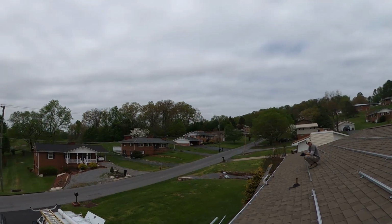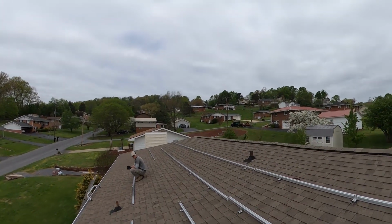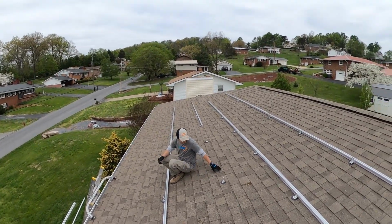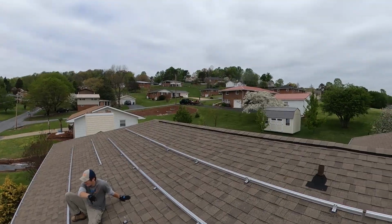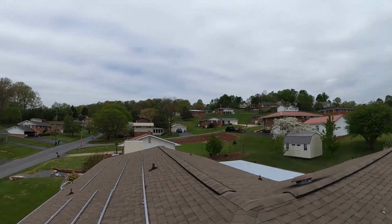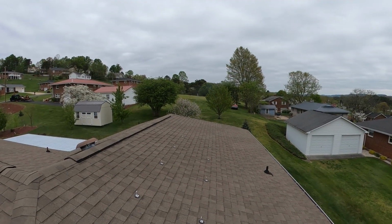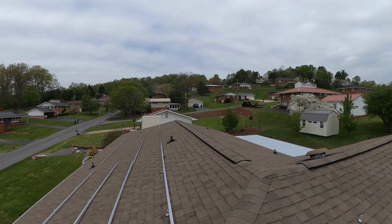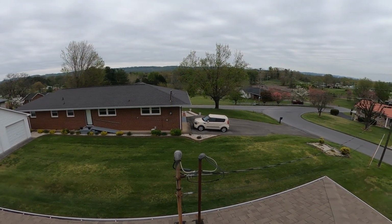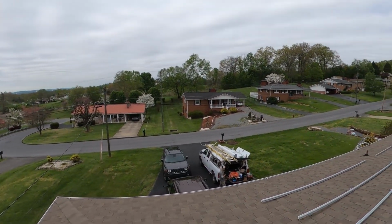It's interesting that these houses were built with the vent pipes on the front. I've never seen that. Maybe it was just easier because they are kind of older and they're cast iron. Yeah. So they typically didn't do that. This is a 10,000 watt system, essentially, and it's going to be split in half with 2 storage inverters and 2 batteries. And because there's 2 meters, you can see here, we got the regular house service, and then we have a little apartment. So the apartment's going to have a battery backup too, which is cool. Huh? Yeah, there you go.